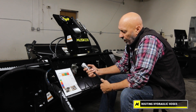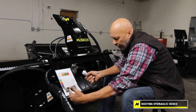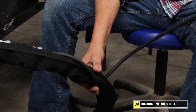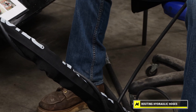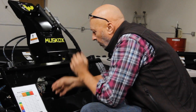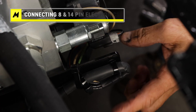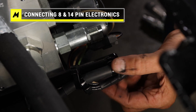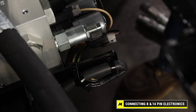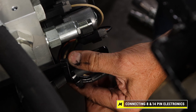I'll show you how we feed the electrical wire through by the block, but we wrap the electrical wire around the hydraulic hoses so it doesn't bulge out and get into a pinch point and cause damage. When we ship the blower, the wire harness comes by this bracket and is cable-tied on. If you replace a harness, just reverse the process — we run the cable along with a couple of cable ties to hold it in position.